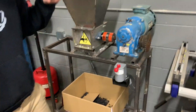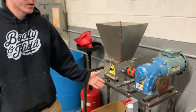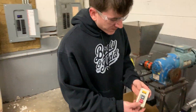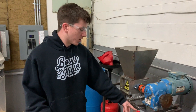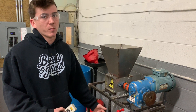This is our motor — this is how we power the shredder. Originally we started off using just an on and off switch, and that did not work because our shredder would jam all the time. This is a reversing drum switch, so if there were ever a jam we just switch it the opposite direction and it comes right out.